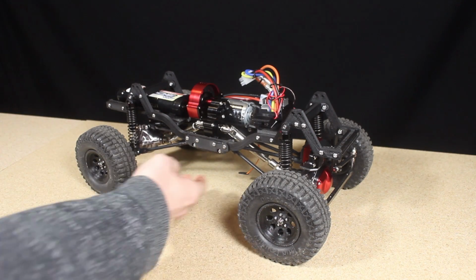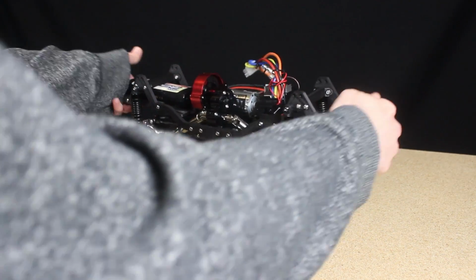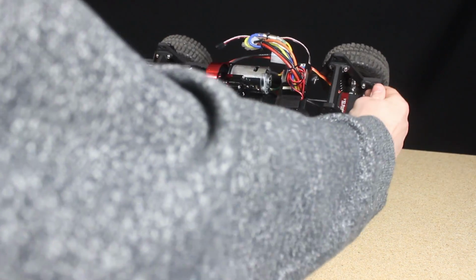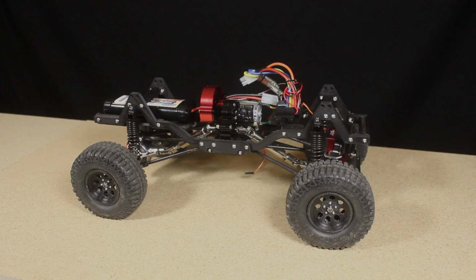So simply replacing the 3mm ABS rails with 5mm PLA did add some rigidity to the chassis. Obviously it's still a bit bendy, but I think I'm going to stick with these PLA frame rails for a while and see how they hold up.